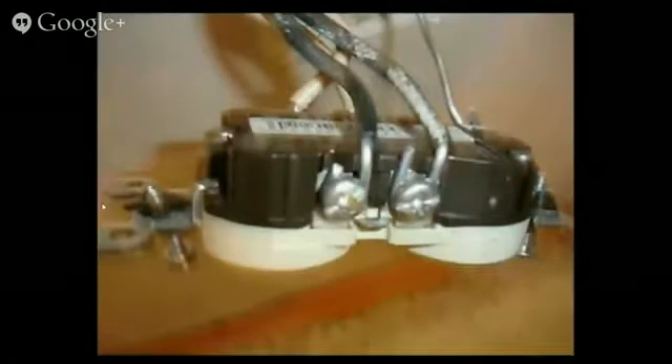So how do you tell if you've got it in your house? I'm going to pull up some photos. This is a receptacle pulled from the wall — it's pretty easy to tell that you've got aluminum. Copper is a shiny gold color and aluminum is generally silver. In some older houses, particularly pre-1950 character homes, you'll see what's called tin copper — where they take copper and put solder on the end of it — and that can confuse newer inspectors where it actually looks like aluminum.